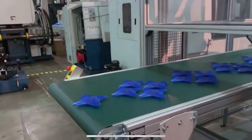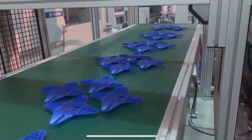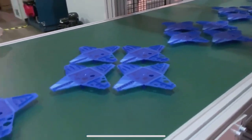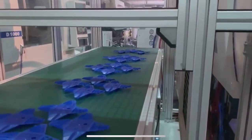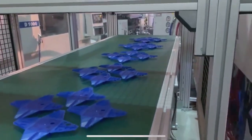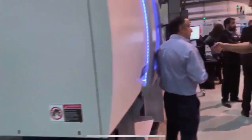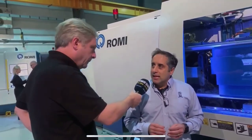This is very big in the US. You can obviously control your production, but you can get traceability as well. We can actually make a template or a saved version of this process and transfer it to any molding machine here, to reproduce exactly the same process on any machine and make the same part. Industries like aerospace and medical especially, where we have to have ultra control over everything, and also feedback and audit traceability on everything that's made.